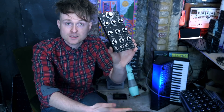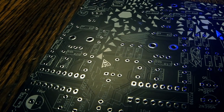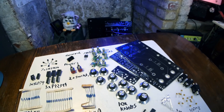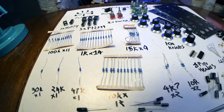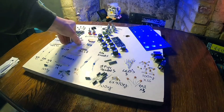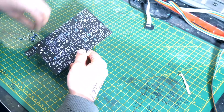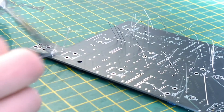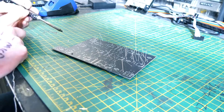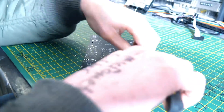So let's build this thing. We've got the panel and PCB set — there are lots of parts in there including resistors, capacitors, IC chips, knobs, and all that stuff. Start with the resistors — look for the numbers on the PCB board, you'll be fine. Get soldering, solder them all in, then get your snippers and snip off the legs.